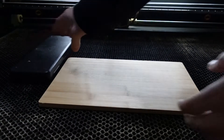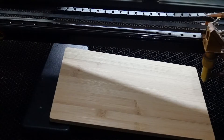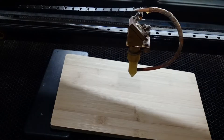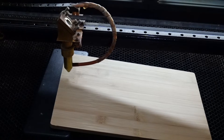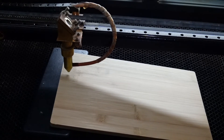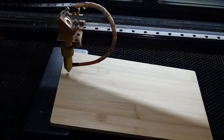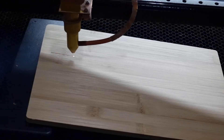Elevate one side of the plywood by putting something underneath it. Now move your laser head to the highest position of the plywood. Load a solid line file in your laser software — if you have issues with that, you can use the file I used, the download is in the video description. Set the power to get a clean solid line and set the file type to cutting. We only want to mark the material; the cut shouldn't go through.